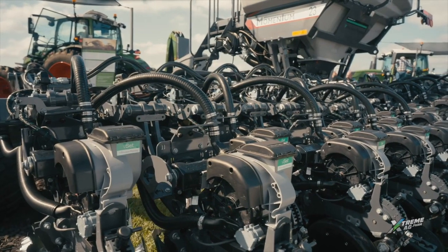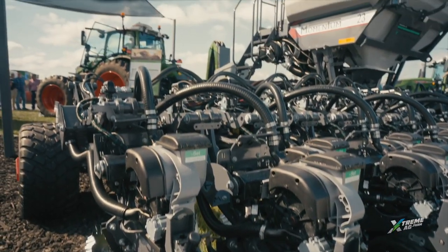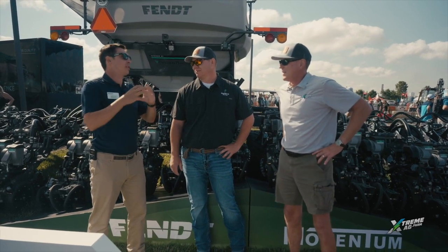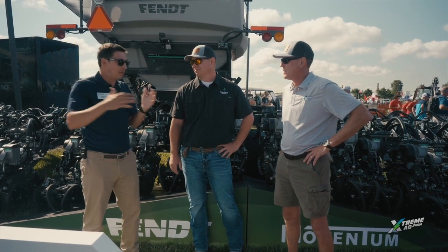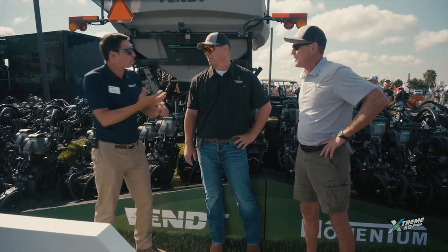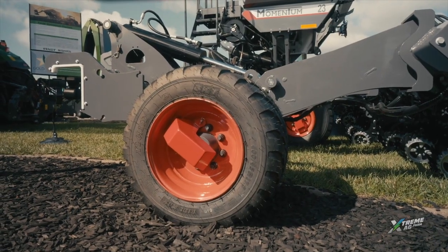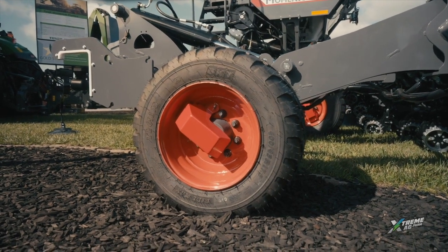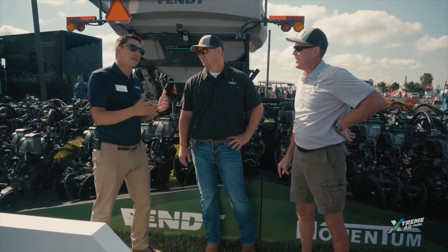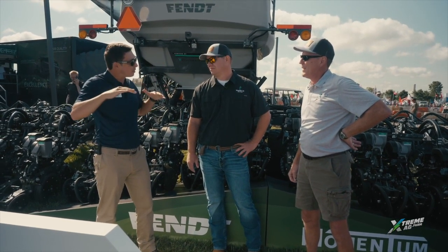Something really exciting is that this has a lot more utility now that you're getting 40 foot, 50 foot, 60 foot, 30 foot options. The ability to plant on multiple farms and multiple crops brings all the agronomy benefits that we know are going to help with emergence and yield. This is what's best about the Momentum — that flexibility of operating in different terrains. We have an automatic tire inflation system, so we can deflate the tires all the way down to 15 PSI. Not only does it allow better traction, it also reduces compaction. Everything happens because we measure the weight of the planter. Inside our rims we have smart spindles, so we're literally measuring the weight of the planter in the wings and in the center. The tire inflation, the precise weight transfer — everything works automatically and in a smart way, not guessing, not estimating. We precisely know how much weight we need to transfer from the heavy tanks in the center to the wings so we can have good weight distribution and even emergence.